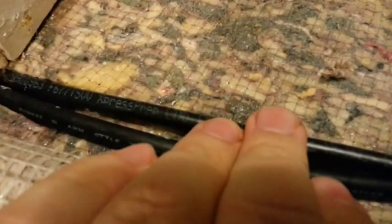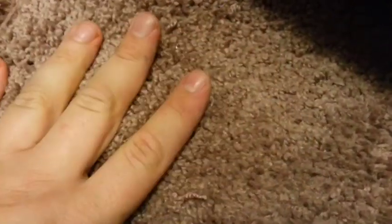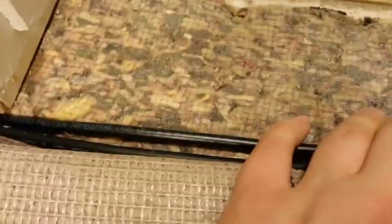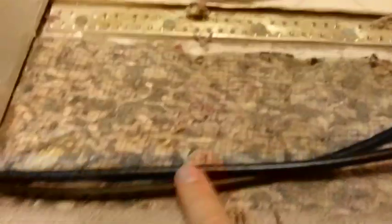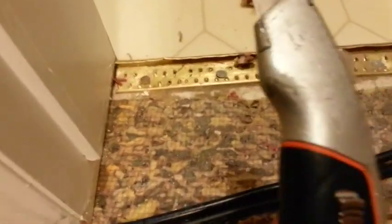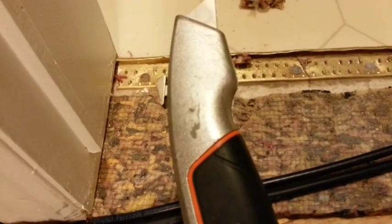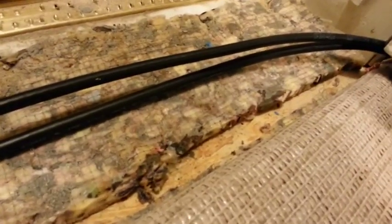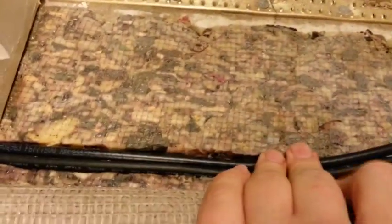I'll lay my two wires right in that foam so you won't feel the wires when you walk — or maybe just a little bit. If you don't fit them in the foam and you lay the carpet, the carpet is going to stick out and every time you walk on it you'll feel the wires. You won't feel them when the wires are in the groove between the foam pad. I just cut the groove with a blade knife — you can use scissors but it's a bit complicated — all the way through the door.